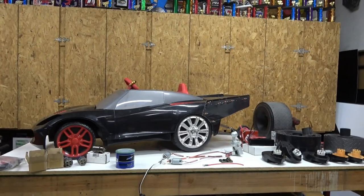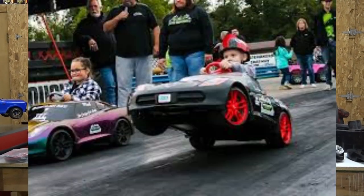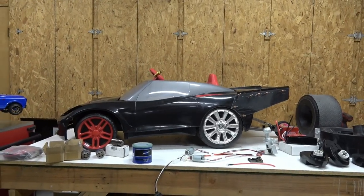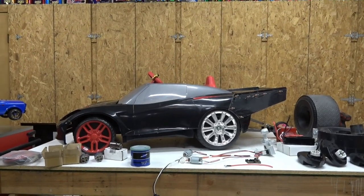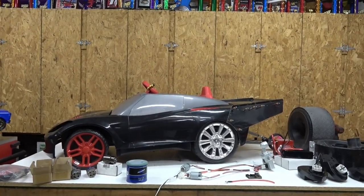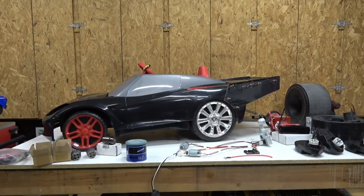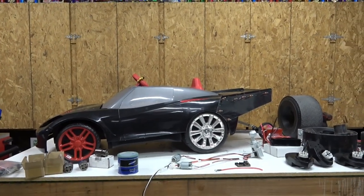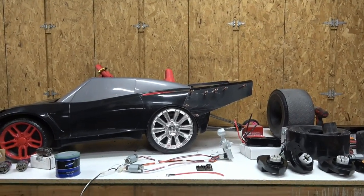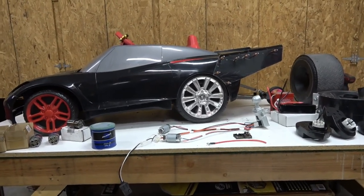Unfortunately my son's racing career took priority and I basically stopped doing YouTube videos for a while. We are back in it — this build is actually for Mel Robinson down in central Ohio's Power Wheels racing. His daughter is a beast and we decided to sponsor them and build them a car. This video is going to be pretty short, just going over what we've done and our opinion of what a Power Wheels drag car should be. We're following four main criteria: tires need grip, wiring needs upgrading, motors need upgrading, and the battery needs more juice.